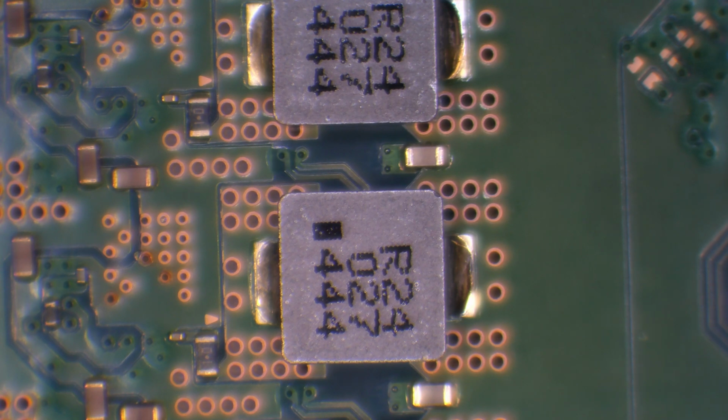Well, I'm just going to look for some areas, just off view, which I might be able to test. Yeah, all of those coils are coming up as low impedance. Well, they're all coming up dead short on the donor board. I don't think there's any way I can test anything around there, like them VRMs or anything. I think it's all too low impedance.